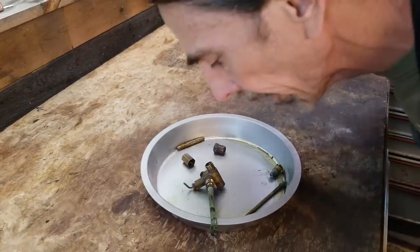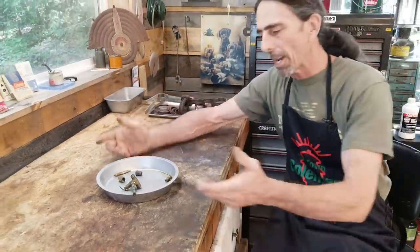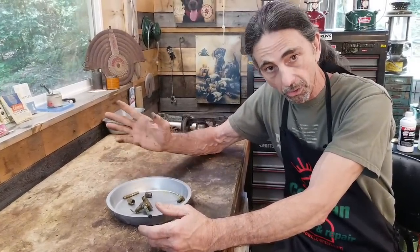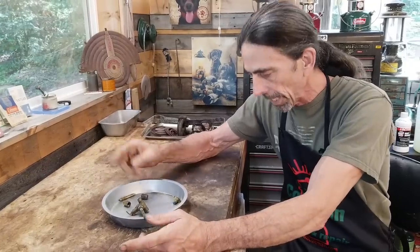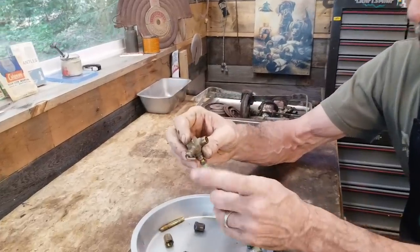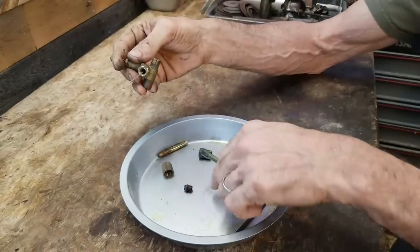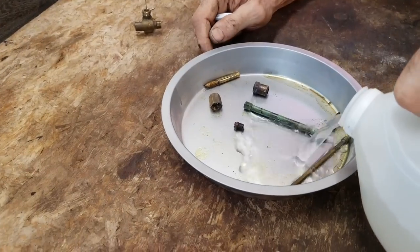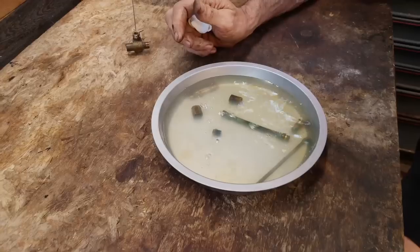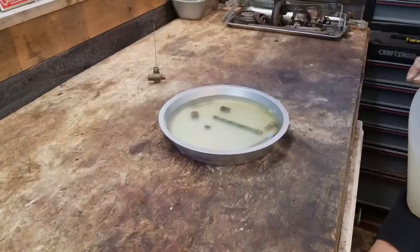Next is our vinegar soak. We are going to soak all of our brass parts. The reason I say brass is because they don't rust, so we don't have to worry about rust — we can just soak these in vinegar and it'll take all the soot and dirt off. Now again, we do not want to soak our valve in vinegar because we don't want to hurt the graphite packing. So we're going to soak the fuel and air tube in vinegar. I'll fill up this little pie pan with vinegar to coat everything and let it sit for half an hour, 45 minutes, maybe an hour.